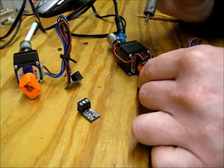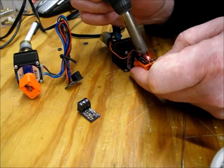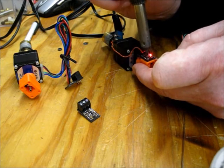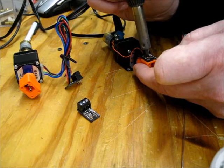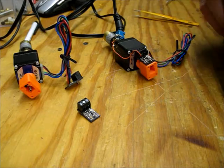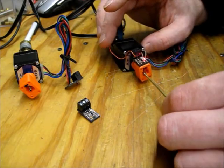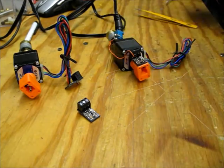Yep. This pin in this top corner is not soldered all the way down. So when I added some more heat and pressed down a bit, the LED went out as expected. Oop. There. So I had a bad solder joint, and there, it's working as expected. So when I block the sensor, the lights come on. Sweet.